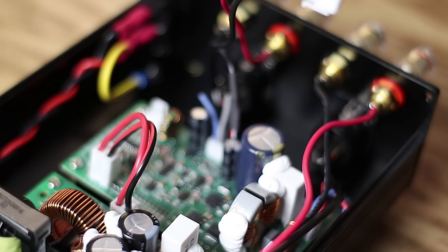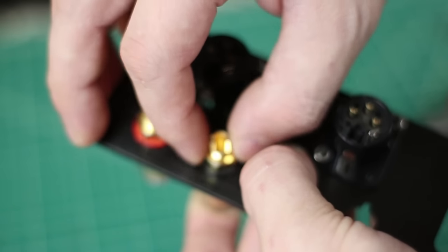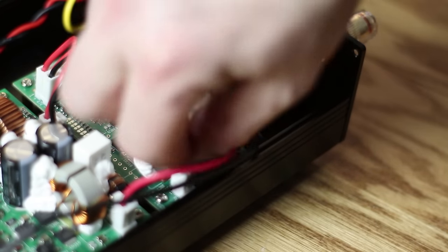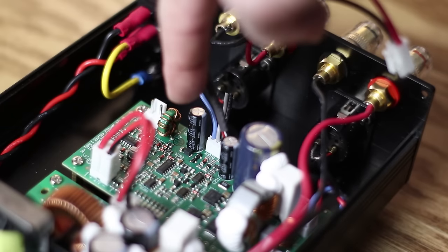The ASP board also has a wire connecting to the binding posts on the amplifier. You can try to solder to them or crimp-connect, but the cables from Ghent Audio are quite short, making crimping tricky. Note that the binding posts come with plastic washers — put those between the case and the nut before tightening. The ASP 200 is now completely wired. For the AS200, you have one wire connecting to the binding posts on the right-hand side and an XLR connector wired just like the other one. All other cables on the AS module can be cut off.